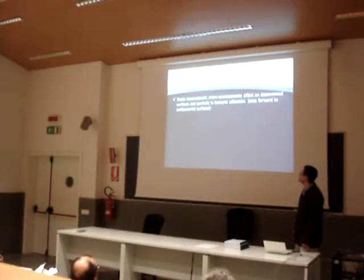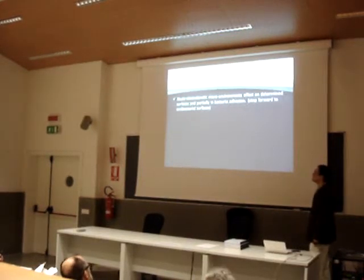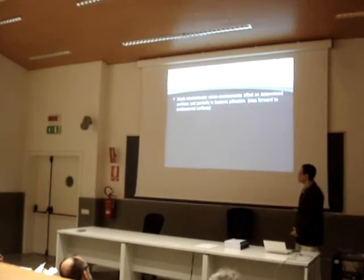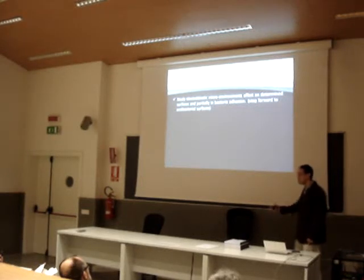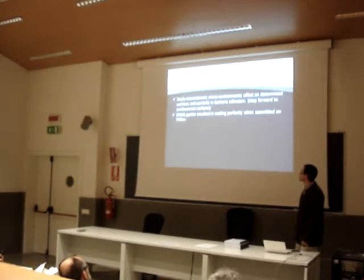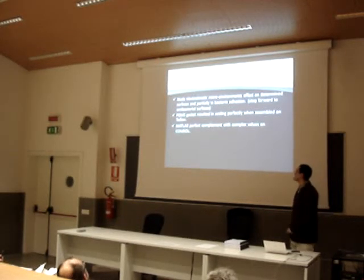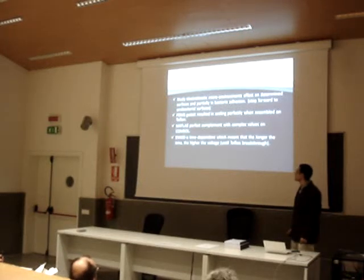So conclusion is a study of the electrokinetic microenvironments that we were aiming to, and it was a really success to enter into these devices. And it's a step forward to looking into the bacterial surfaces. The PDMS gasket resulted to be a good sealing in the chip, even with the Teflon, that this was really hydrophobic. The MATLAB complemented really well to the COMSOL simulation.